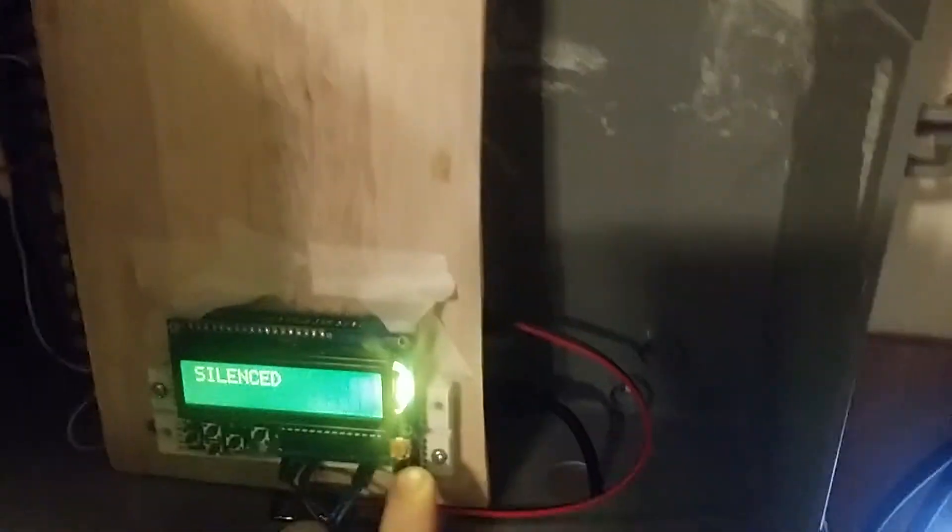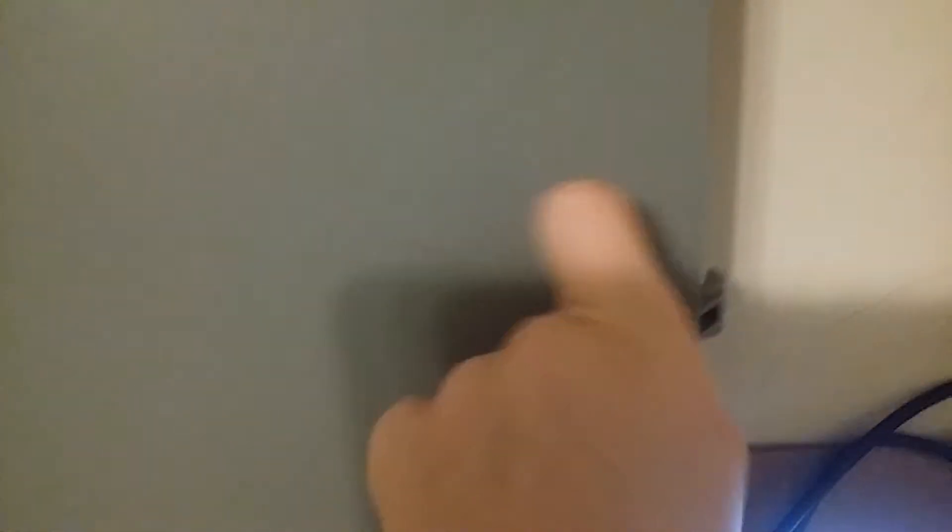Now this doesn't have the clean me function that puts a supervisory in the panel when that happens, but what it will do is let me know whenever I test it. It does a functional test of the actual sensor. We'll reset the panel. That's pretty neat — I've got a smoke detector in the system now, wired on zone 1 as I mentioned. Just for the fun of it, we will hit the pull station as well. Show off the panel open.